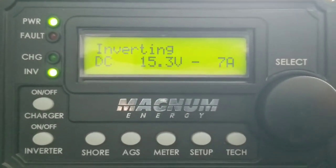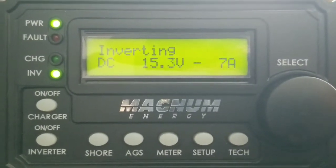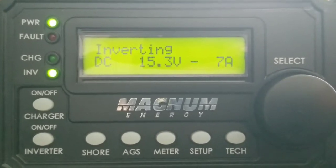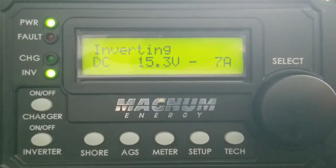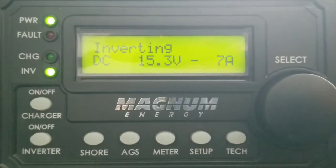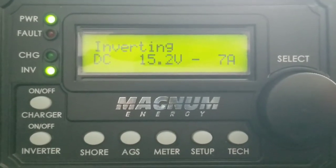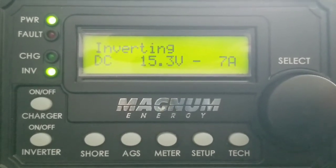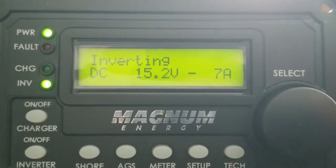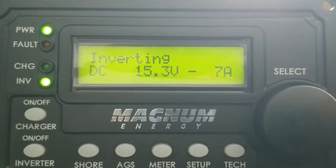Look at how many amps it took. This is how you go about choosing an inverter for your off-grid solar system — one that can surge higher and give you the right power when you need it, at startup for compressors, heaters, whatever you name them.